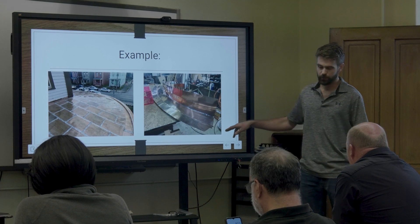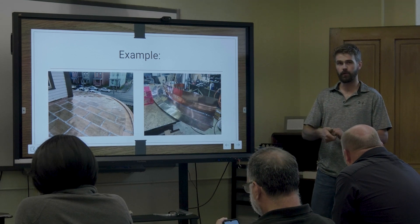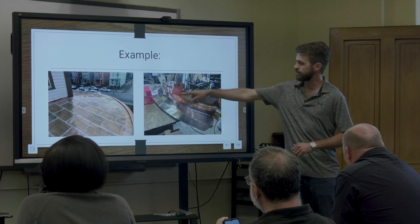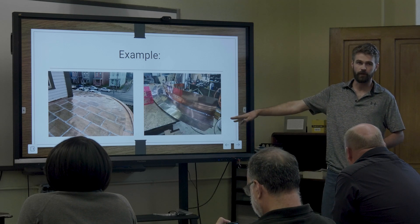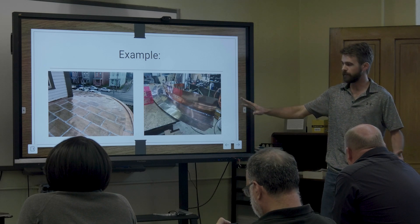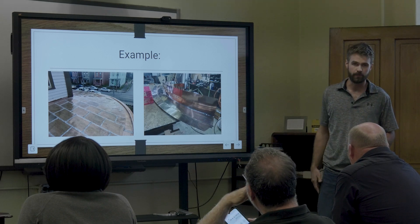This is what we call a Pittsburgh lock, where the back piece is separate from the bottom but locks into it so that even if it has a pinhole, if it's pitched correctly, you're not going to get water behind it. But at the end of the day it needs to be properly soldered. Fewer seams is better.